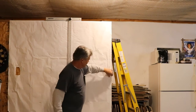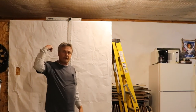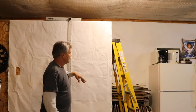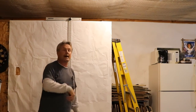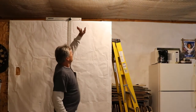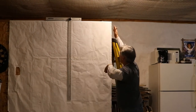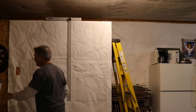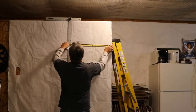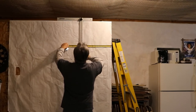Because it is lightweight material, if you have a flat surface you can roll it out - it's ten feet wide. Whatever you need to do to make it easy. We're only doing these two small pieces up there, so if you're running a long wall like this, you really don't even need a setup. You can just simply staple the top, the bottom, keep everything square, and roll it out. We're going to measure out an 18-inch piece here and cut this thing off. I've got an extra two and a half feet laying on top. I'm going to use this as my square edge on top and side and let's give us an 18-inch mark here.